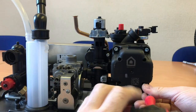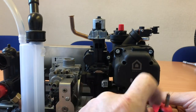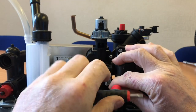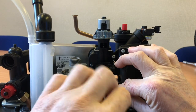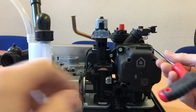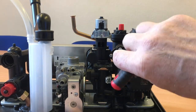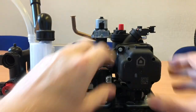This is one of the new ERP pumps. Where the ERP pumps differ from the old pumps is basically the speed of this pump is modulated by the PCB, working off two thermistors - one on the flow and one on the return. The hotter the return comes back, the slower the pump will run to try to dissipate heat through the radiators. Unlike the old pumps which had three speeds, this has numerous speeds and will slow down and speed up depending on the flow required for the central heating.